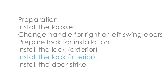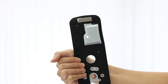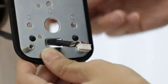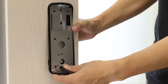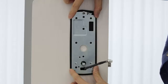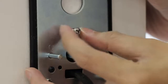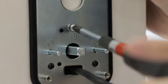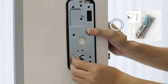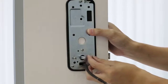Install the lock interior. If using adhesives to secure the upper part of the lock, remove the cover off of the adhesive tape on the mounting plate. Place the mounting plate on the door, ensuring that the cable is guided through the rectangular hole near the bottom of the mounting plate. Make sure that the spindle and the positioning rods are passing through their respective openings. Align the mounting plate straight. Secure the hole above the spindle with screw O. Once the screw has been inserted correctly, make five turns clockwise by hand, then tighten the screw. Remove the positioning rods V and replace them with two screws O. Once the screws have been inserted correctly, make five turns clockwise by hand, then tighten the screws.